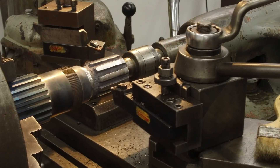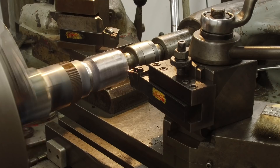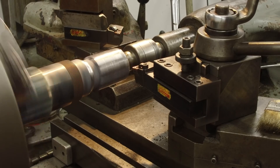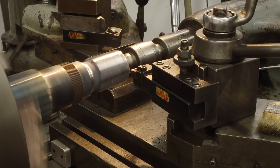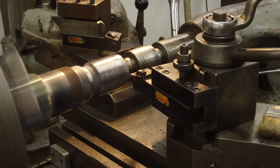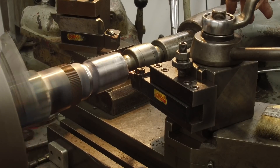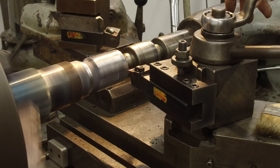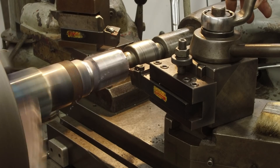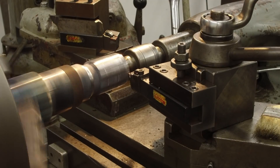I'm going to index my insert there — I think we've got a little wear on it. Here's a brand new insert. I think our other one was already chipped or whatever. We took 50 thou on the last cut; we'll do another 50 just to compare the difference. Of course we still have the feed rate slowed down. It sounds a lot sharper, looks a lot sharper — chips are flying off a little differently now, and the finish is much better.